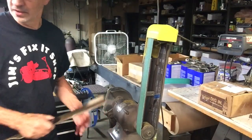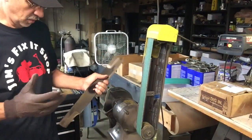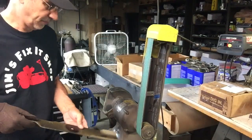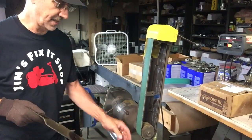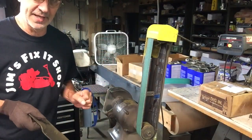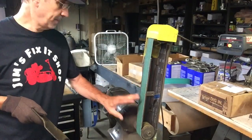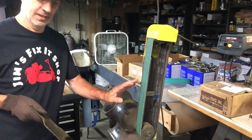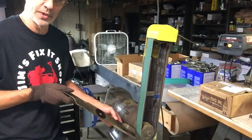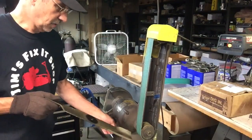So let's give this a shot and I'll show you what I do. I typically wear one glove on my right hand, and that's only because when you get done doing one end and you flip it, it's a little bit hot to hang on to. I don't like to wear a glove on my other hand in case I hit the belt — sometimes these blades as you're going will slip off and you'll get bit. I'm in the process of building myself one of these, but I'm going to make a left-hand one instead of a right-hand one, because when you're doing snapper blades with the big air lift on them it hits on the motor. So if I'm on this side, there's nothing in the way for the blade to hit.